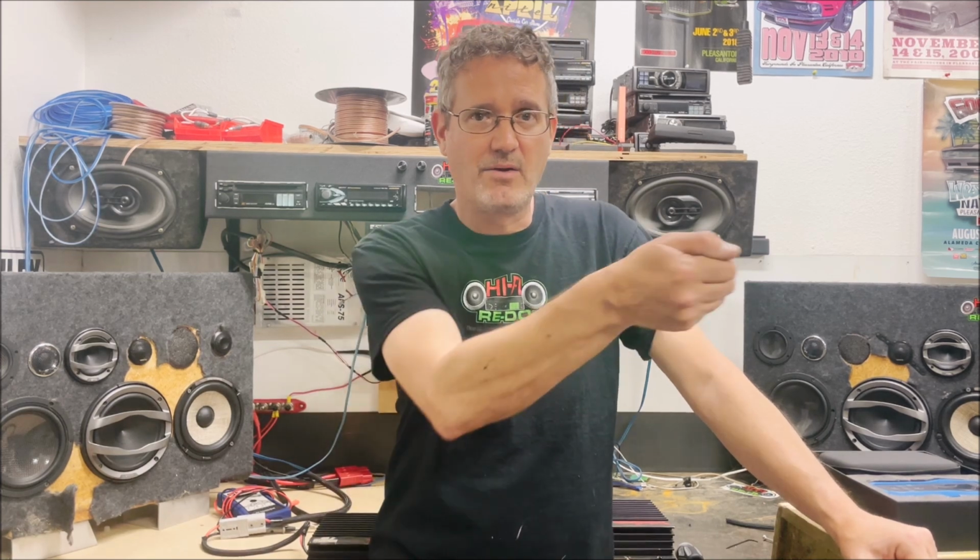And I'll tell you what, that polarity checker where you stick it on that beep track and stick it up to the speaker, that thing's awesome. I mean, that is great. Any installer, anytime you install, not even just a professional installer, anybody, you install a system, I tell you what, you need to load that track on there and go around to your speakers and check them all. That's pretty serious stuff. And then, obviously, setting your gains.